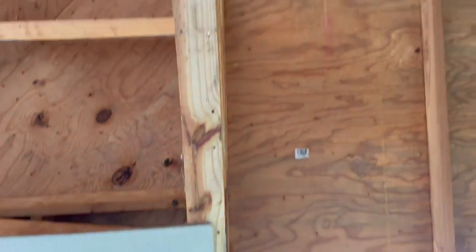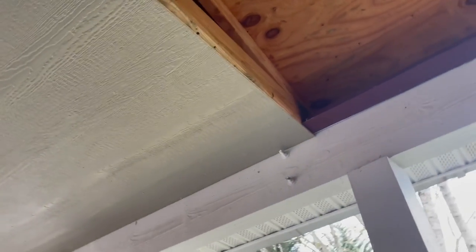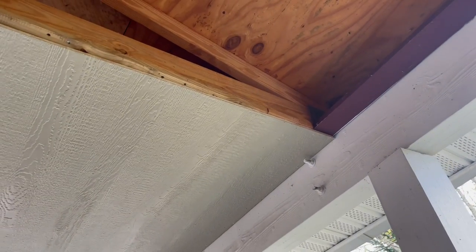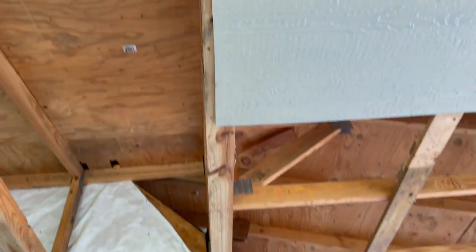As you can see, and something that Stephanie pointed out, this truss right here obviously has a little bit of wank to it, so I'm gonna have to put a nailer there, which is no big deal. But the biggest thing I want to make sure is that this line here all lines up so that when I put my batten on there, it looks good.